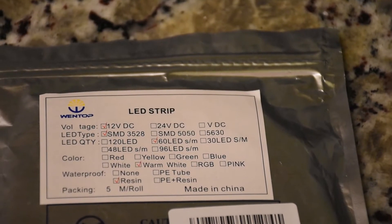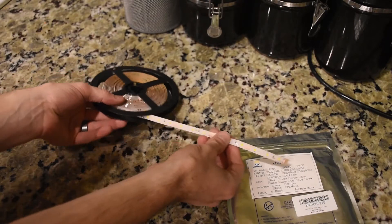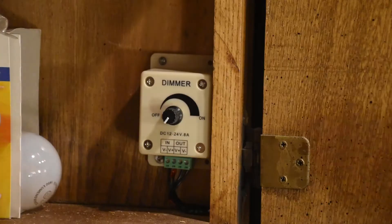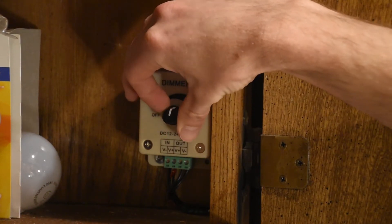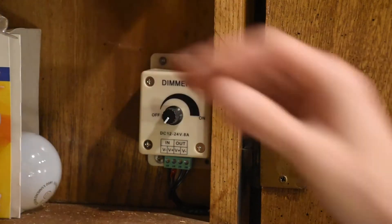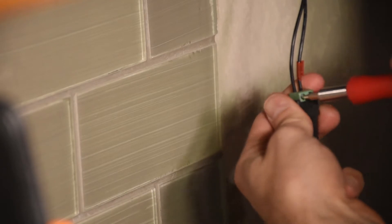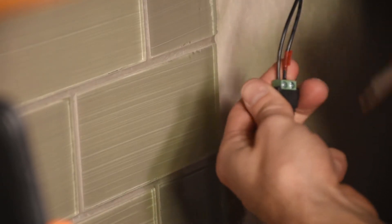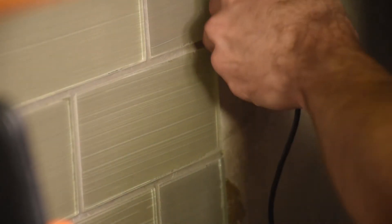These little lights here are the 35-28 size. I didn't go with the 50-50 size because I wanted to keep the power requirements low and it costs about half as much. This little dimmer here was ordered separately on Amazon and it's how I control the lights — I just hid it here in the cabinet next to the fridge. These SMD LEDs came with this little power supply. One end simply screws onto the wires that feed the dimmer switch and the power supply simply plugs in right here. I plug these lights in behind the fridge into the second outlet back there.